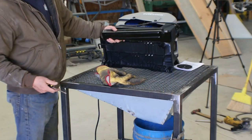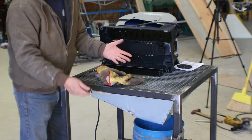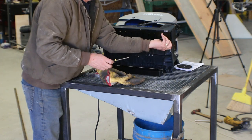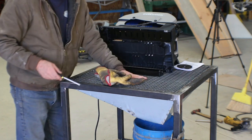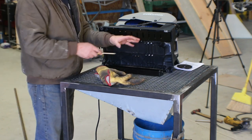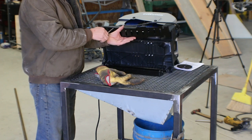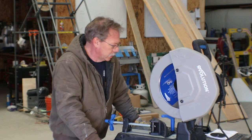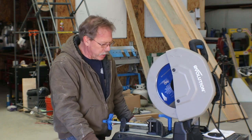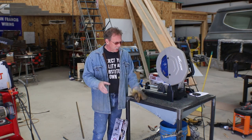This saw comes with a chip tray that slides in here, and we basically built our own chip tray, so I'm going to take this additional cover off so that all the chips will drop straight down. I went ahead and got my funnel built and put some expanded metal in. The next thing will be figuring out how to mount the turntable piece and get a plate built that the saw can sit on. I've been off and on on this project all day between subcontractors showing up to do work on the house, but I did get the funnel built and the bottom shelf in.